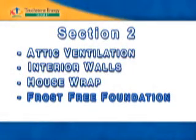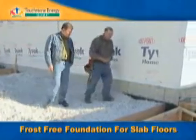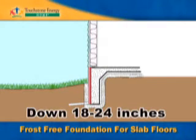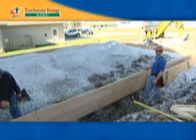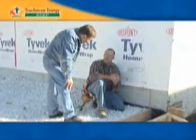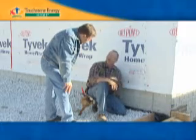Now, where are we standing in relationship to the house? This looks like it's been framed out in some way. What we've got right here is the garage area and we've put in all this rock for drainage and support. We're going to have two inches of foam on top of that. We're also doing a frost-free foundation system. The key to a frost-free foundation is we don't have to do nearly as much excavation — we can go down 18 to 24 inches, then go out horizontally with four inches, two-inches-thick foam, about four feet. That way the frost can't get all the way back. If we go four feet in the ground we go out the same distance. It's nothing new — it just became code a couple years ago, but the Europeans and Canadians have been using them for decades. Finally the physics caught up in the United States, and it's a beautiful way to do a foundation system without a whole lot of excavation.